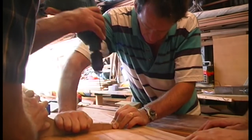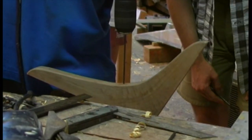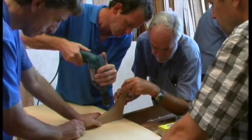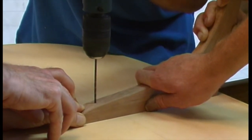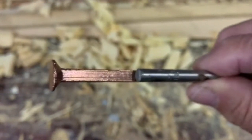If you don't have the manpower to hold the parts together, you'll need to get inventive with clamps and blocks of wood. Drill the holes through the knee first, then locate it exactly in position, remembering to allow room for the keel batten, and continue the drilled holes right through the transom.